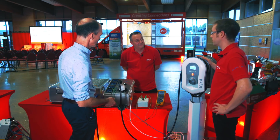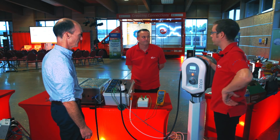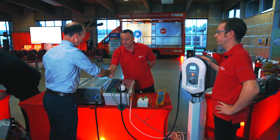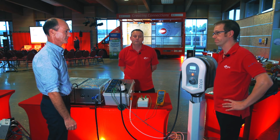That's really impressive. But if you look along your road, every other house, there might be an issue. So I think that clearly demonstrates the technology within the Zappi 2 that we've looked at, and also emphasizes how safe this device is in terms of keeping people safe under that realistic fault situation. Chris, thank you ever so much for showing us. That's a very good way of seeing the issues that we may have with Amendment 1.